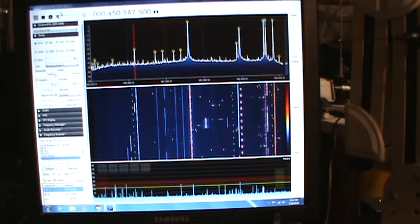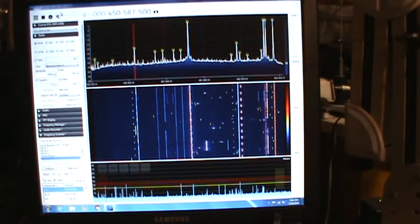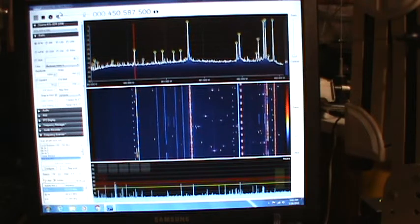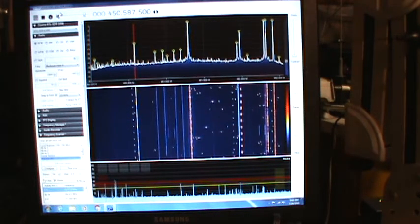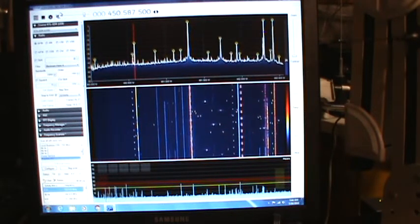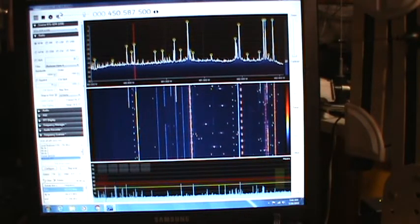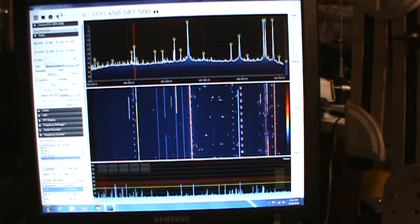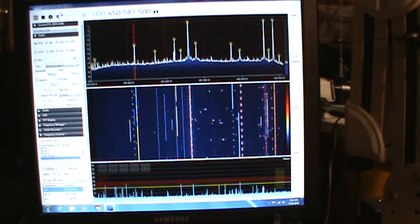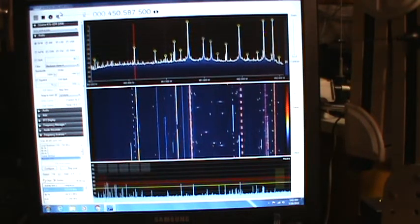And it worked okay. And the thing is, even the cheaper ones will work on VHF and UHF pretty darn good. They won't work on HF, even with some of these softwares that have conversions that'll put it in different modes. Typically, when you put it in those different modes, the HF is not that good if the dongle was not designed for that. So the $15 one I tried this morning had a problem with the connector. I couldn't get the cable to stay in the connector that came with it. So I gave up on that one and went to this one.